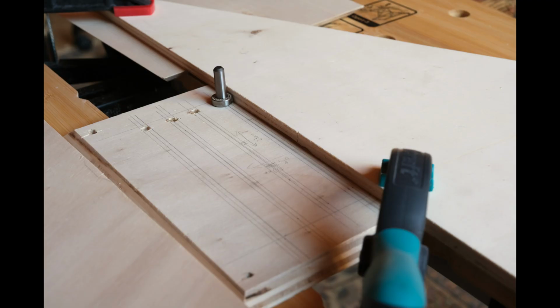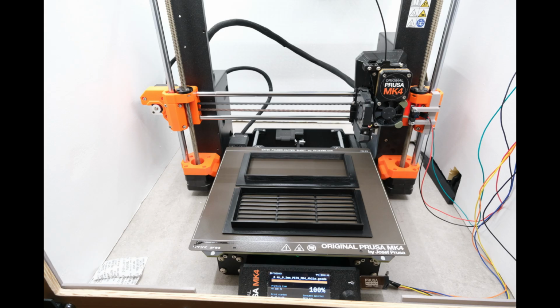Since it can get quite hot inside the case, especially during summer, I installed a fan and a temperature sensor. For the ventilation system, I cut 2 holes on each end of the box. The fan is mounted in one of the holes and it will suck in air. Initially I wanted to cut ventilation slits into the wall on the other end of the box, but that didn't look so good. So instead I cut a hole and I 3D printed a part to partially cover it.